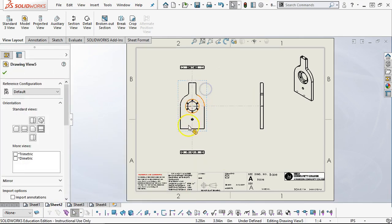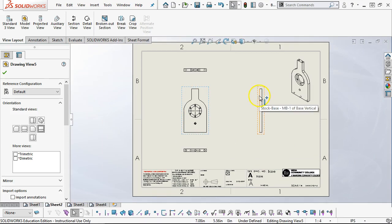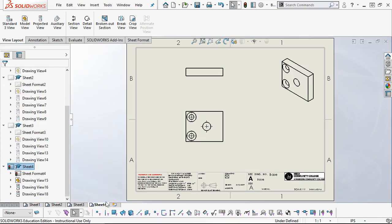Quite a few, I'm going to say, the front and the back. Other than where it contacts the gusset, I don't know that it's that critical. But I would need that perpendicularity back to the base, and that everything is vertical, and then we could have positional tolerances around the holes. And we're going to look at the stack up of the bearing housing of how it fits through those parts. All right, so that should take care of those components. 1, 2, 3, 4.